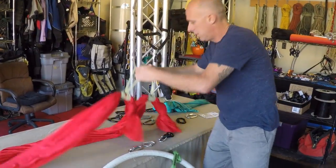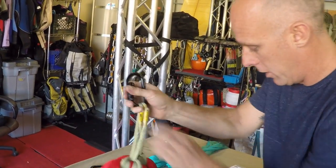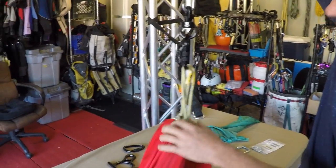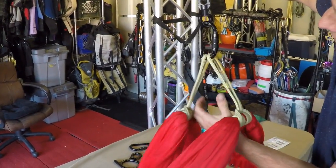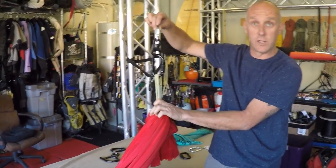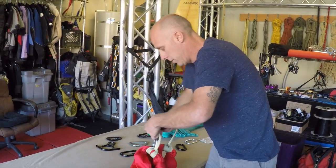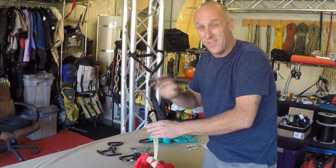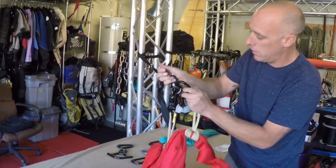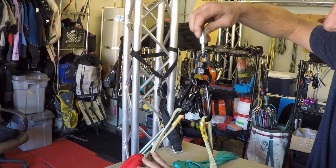Let's take a look at a couple of other pieces. This is borderline — right now this would not be a three-way load, and I'd be just barely within saying this is properly loaded. But what I'm worried about is once the rig starts getting used, is the performer going to spread these silks and start creating a three-way load? In its resting position this looks like a good idea, but we could start seeing a three-way load. One way to quickly get around that is to use a piece of gear designed for a three-way load. In this scenario, the base of this large swivel can handle a three-way load — just like so. This is an appropriate use of the carabiners and an appropriate application for a three-way load.